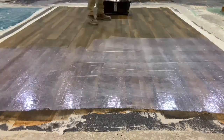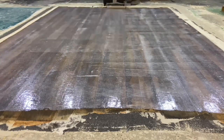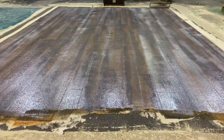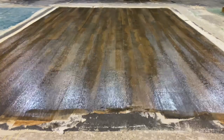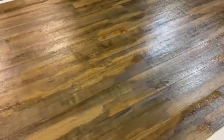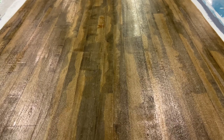There is no exact technique for applying a water-based urethane. The idea is to roll out any roller lines so that when it cures, it is free of marks or ridges. There is no one rule when it comes to doing a wood plank design — no necessarily right or wrong way to create the patterns. The main aim is to mimic natural wood flooring, so color choice is important, and plank width and length is important.